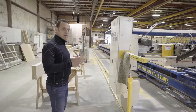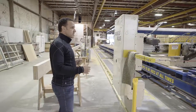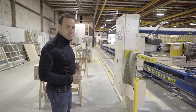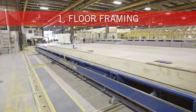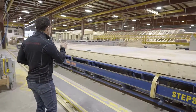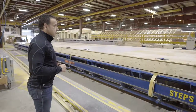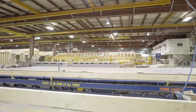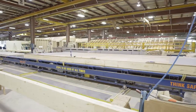There are going to be 18 workstations and I'll show you each workstation and how they add value to the process until we get to the end where you'll actually see the finished product. This here is our flooring station — we're taking our lumber from a pre-cut section at the back, laying it out with all the joists, and then bringing the gantry across to glue and screw it in place. What that means to you, the homeowner, is that you're getting a really robust, squeak-free floor system.